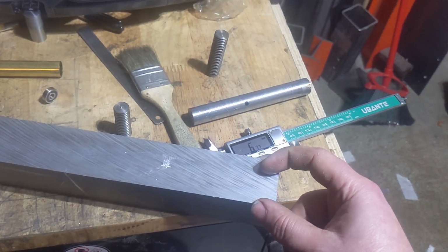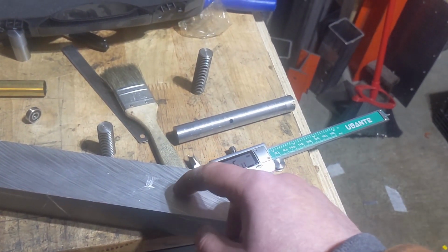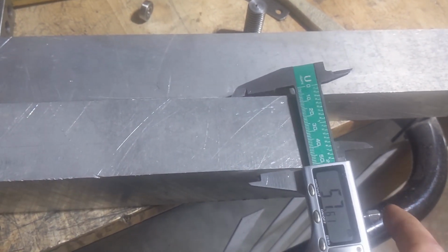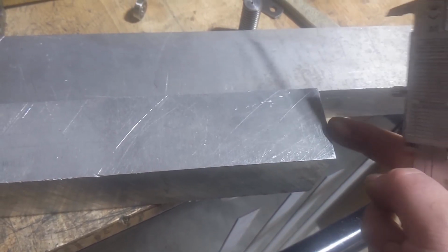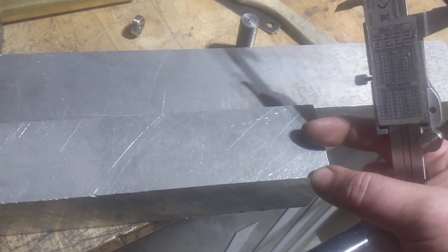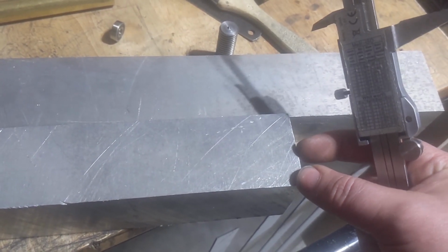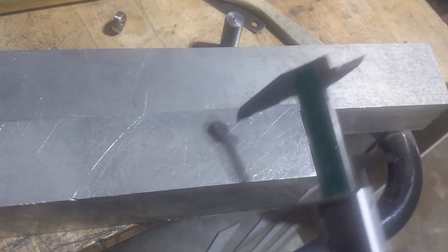I need at least, I'm going to say at least 20 millimeters. And splitting this is also more machining and yak shaving that I don't want to do. So yeah, I got to think about this one. I think I'm going to use this and split it in half. My 6 millimeter rougher, I don't really even have any larger tools that are 40 millimeters. So I can't interpolate a hole unless the stock's less than 25 millimeters. So I'm going to use a 25 millimeter tool and then just split this down the middle.